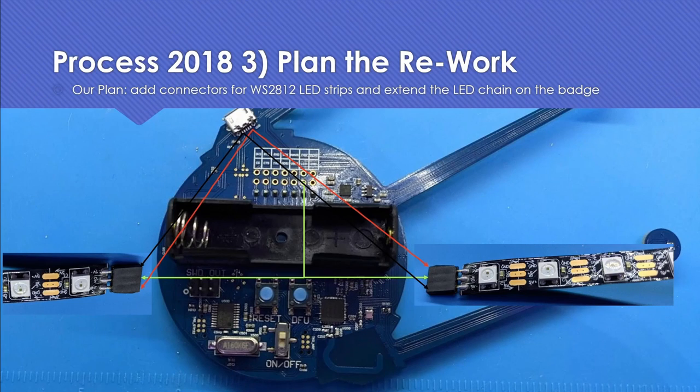To avoid those problems, we're going to go straight for the 5V and then supply as much current as we can from the USB port we're plugging into. The problem is that the LEDs are running at 5V and the NRF52 is running at 3.3V, so we're going to need to introduce some kind of level translation. That green line connecting the LED to the strips is just notional — we're going to need something else.